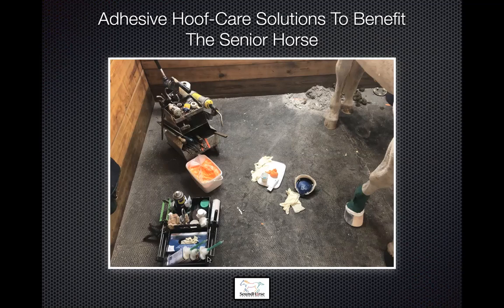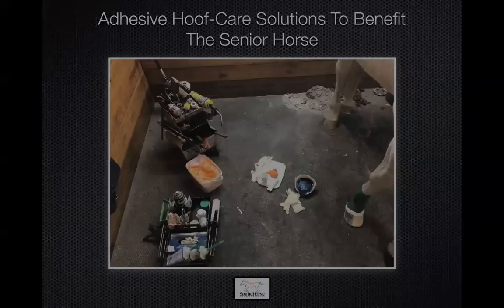So if things start unfolding, especially in summer, the glues set up a lot quicker. These methacrylate glues can be affected by ambient temperature. So just a point that we really need to be aware of. For me, I like being organized, and I like having everything right next to me when I'm gluing.